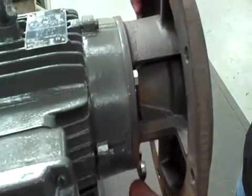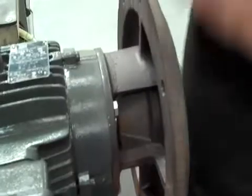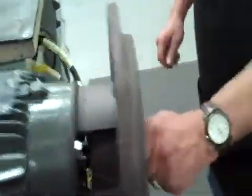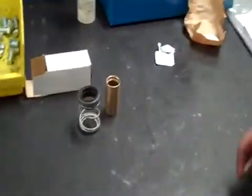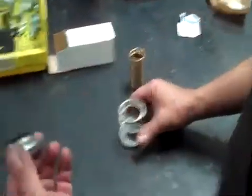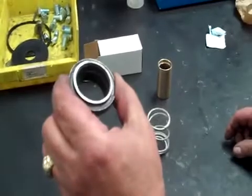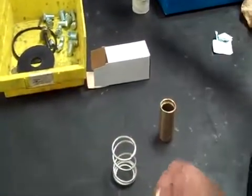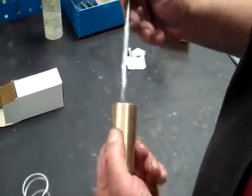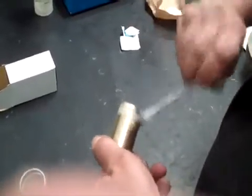You want to get this fairly snug so it stays straight. You have room for adjustment after you get the case on. Once you get that set, you want to fit the keyway — face it straight up so it's easier to align everything. When you come back over to the seat, you top the little seat base off, leave the spring and the flat part in there. Get a little more lube — I like to put just a little bit on the lip here, and then some on the outside of the sleeve.